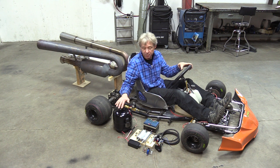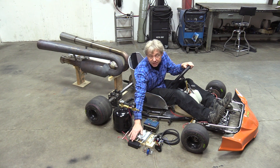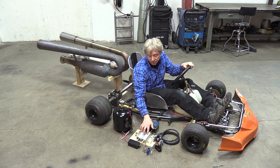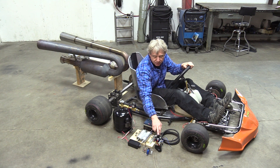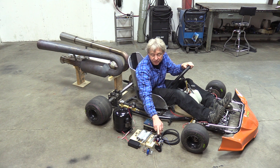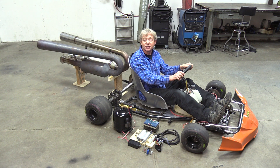The propane is just for starting — push a button and the engine fires to life instantly. You don't need any starting air or anything like that. Then we have a speed control down here that controls the speed of our pumps, which gives us our throttle. A couple of switches, a 12-volt coil with a couple of little things on it that I'll show you later that turn it into a spark box, a little bit of hose — and that's all we need. Let's get going on this cool build.